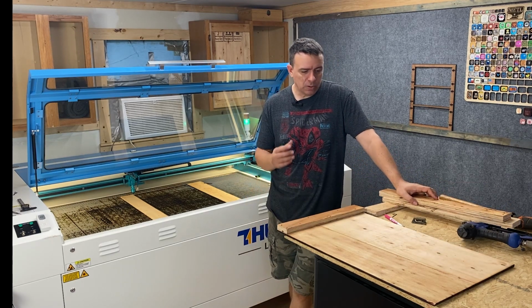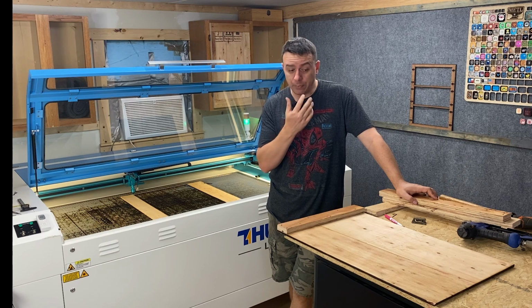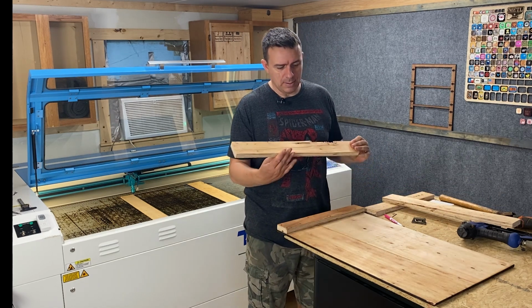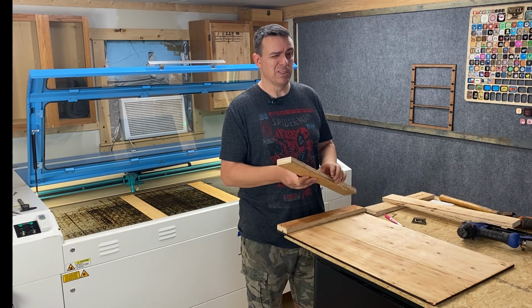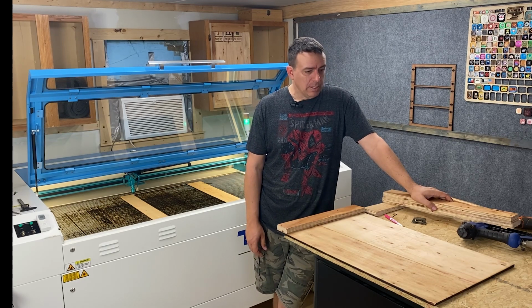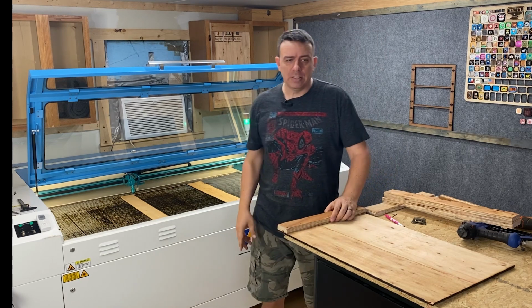So instead I used my skill saw and carefully cut the thin pieces out, and I ended up with several board feet of the 1/4 inch stuff and a bunch of lengths of this thicker plywood as well. You just have to make sure you don't hit the nails with your skill saw, or it makes an ugly sound and you might get hurt. It was pretty easy. Once you have everything cut out, I measured the openings on my cabinets.